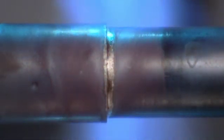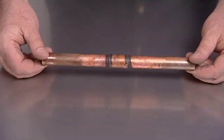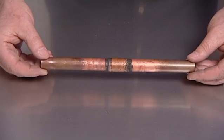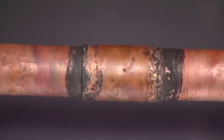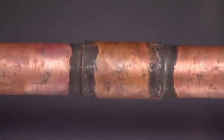The alloy flows from the inside to the exterior via capillary attraction. Heat towards the top for a second or two to pull the alloy through. The alloy will flow to the area with the highest heat. After brazing, inspect the joint for a small uniform fillet at the brazed joint. The presence of a fillet indicates that the filler metal has completely flowed from one end of the joint to the other.